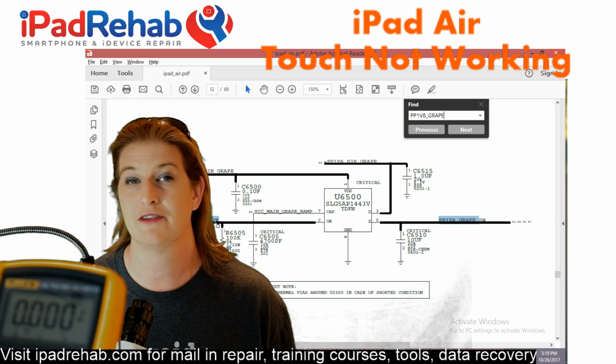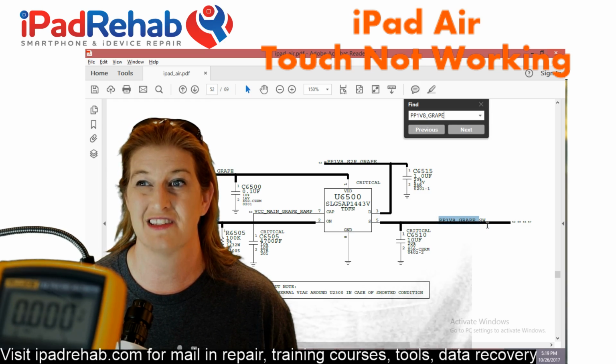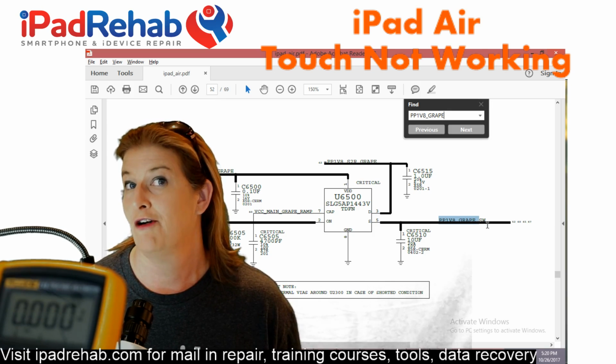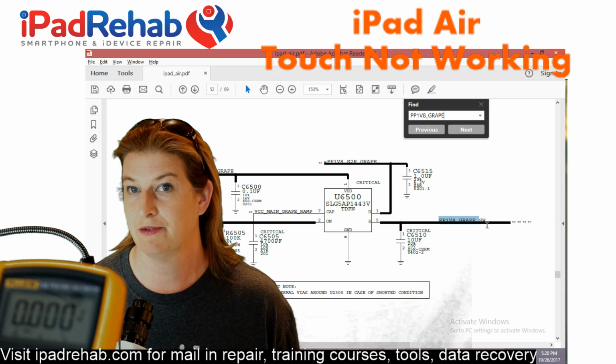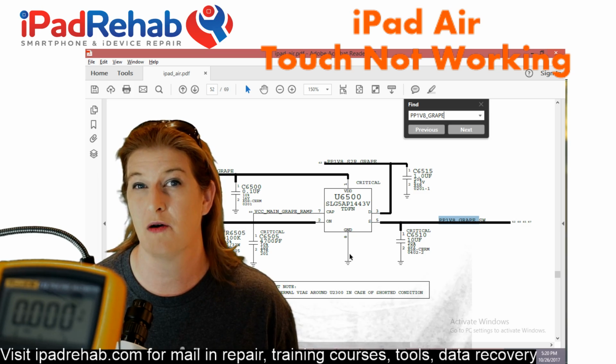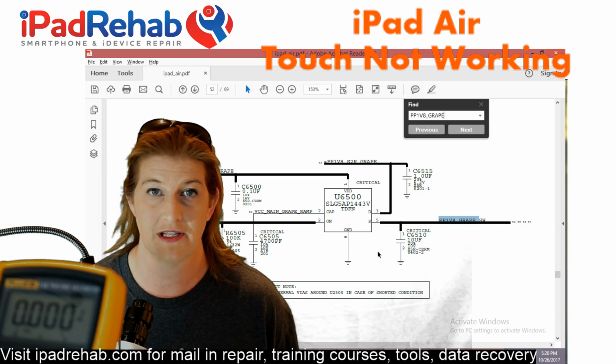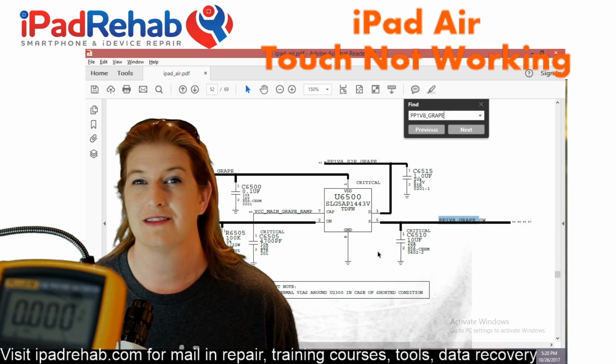All right, so what do we know right now? We know that PP1V8 grape is missing, and we know that PP1V8 grape SW is therefore also missing. So what should we do? Now we're at the end of our investigation, at least of this power rail. And it may be that our PP5V25 is also missing. We don't really know.